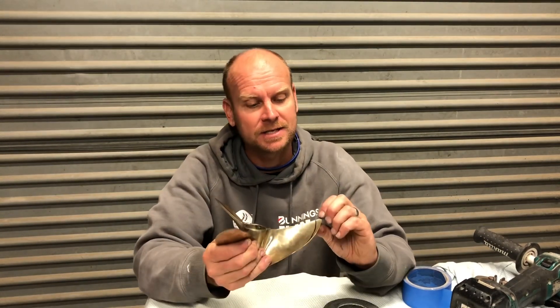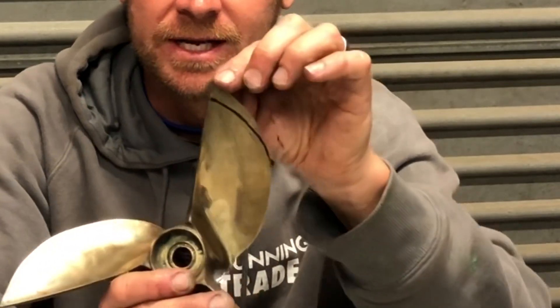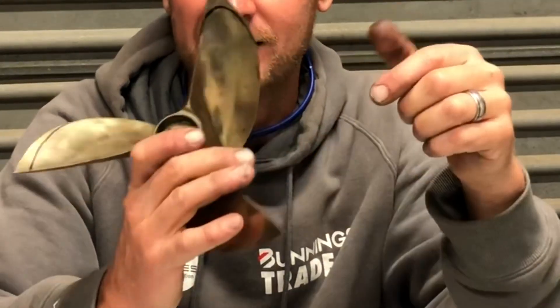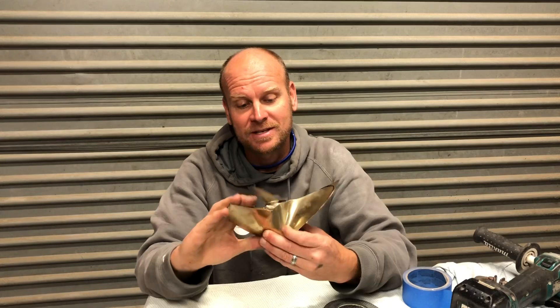Now that I have the spline in for the motor I'm putting it on, I need to reduce the blade diameter a little bit — I've got to take just over half an inch off each blade. There are two options: just remove the tips to bring the diameter down and keep it as a cleaver style prop, or round them off slightly — in between a cleaver style and a chopper style. A few mates have run props like that and it's worked well, so I'm going to give it a go. I don't want to remove any material off the leading edge because I have a feeling this is already going to be too much pitch for the motor, and removing the leading edge actually increases prop pitch. So I'll mark them all with a template, sharpen it, and then balance it — fingers crossed this works.